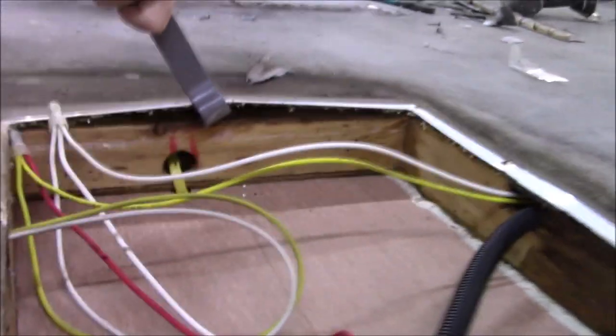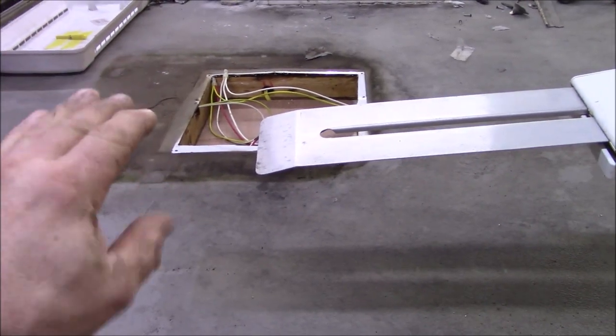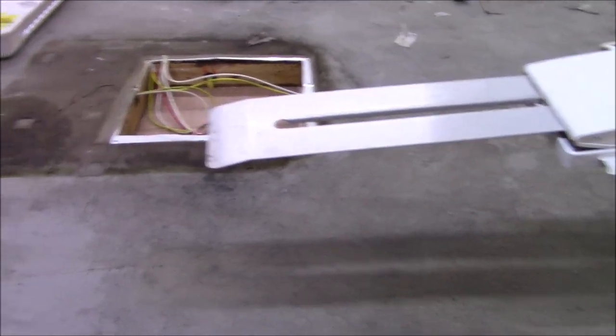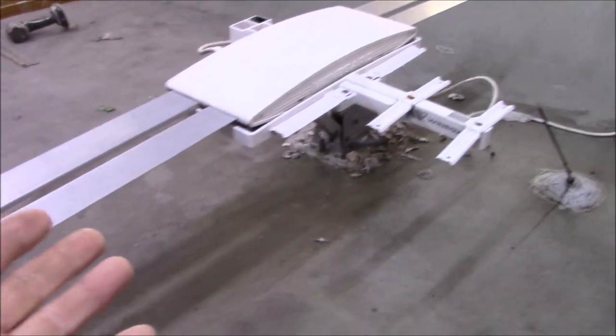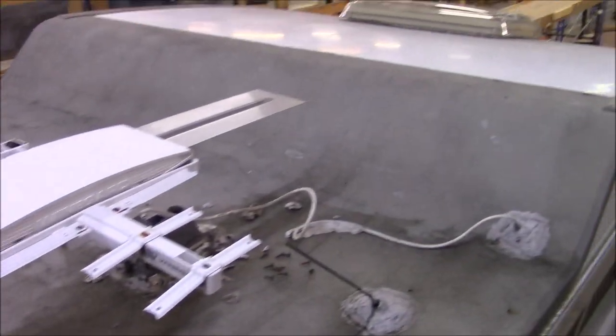Here's something interesting — this was an aluminum roof, and it's ply foam, meaning inside this hole underneath is all foam. There's no need to tear all this off because the deck and everything is sound. If we try tearing it up we're going to compromise the ceiling. The ceiling, the foam, and the roof deck are all glued and laminated together. It's unusual that they had this sprayed because aluminum is a far better reflector of UV light than this spray will ever be. Someone must have thought spraying would solve the leaks, but you can see it didn't.